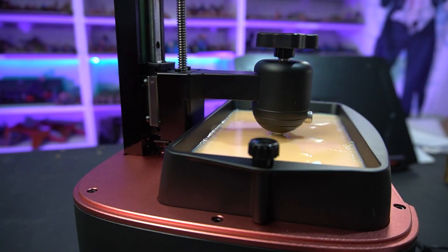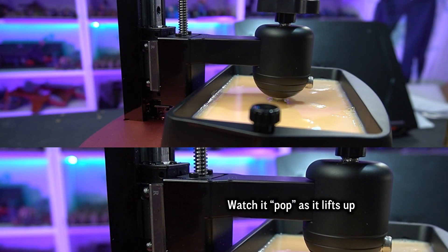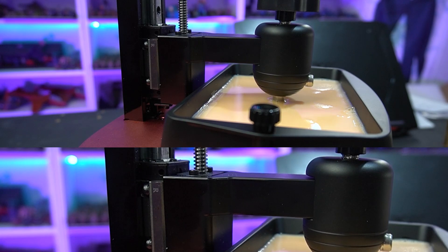The only downside is the slight Z-wobble that I've noticed during printing. This was alerted to me by other people who have reviewed the Elegoo Mars 3. As you can see on this recording, the Z-axis is slightly moving as it lifts the layers up. Clearly it hasn't affected any of my prints since I haven't had a fail, but long term I can seriously see this being an issue. Now, this is a review version of the machine — not a finalized version. I'll be speaking to Elegoo about this, so hopefully when the Mars 3 goes to retail it won't have this problem, because whilst it's not affecting prints now, it could damage the machine long term.